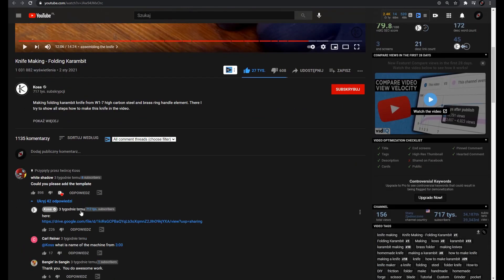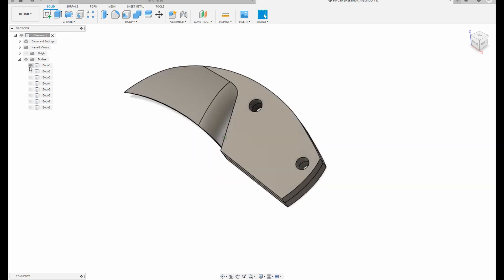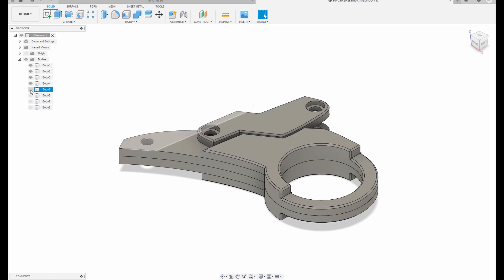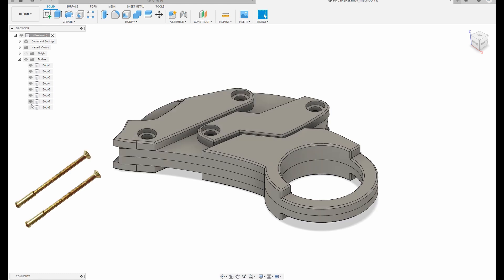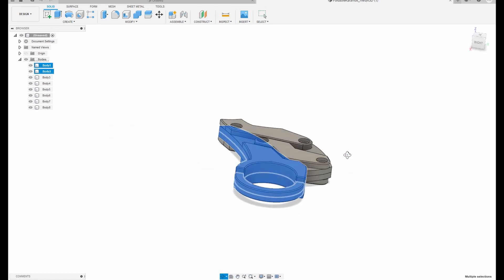I downloaded the file, made a screenshot of it, opened Fusion 360, imported the canvas, scaled it and followed the lines to create the sketches. Then extruded them and added edge angle. I split the blade and handle into two parts for easier printing. I dimensioned all the holes so I can fit my door handle screws I had laying around, but it's also possible to use regular M3 screws.